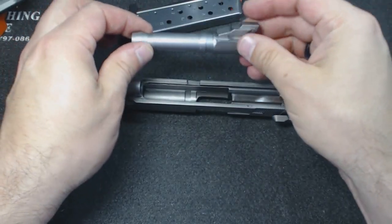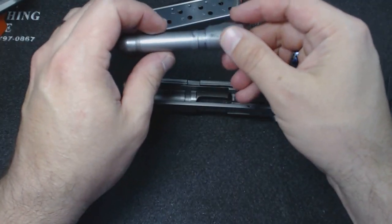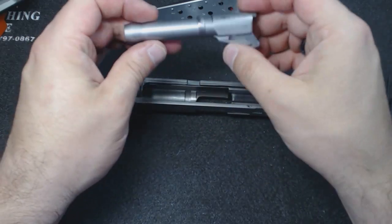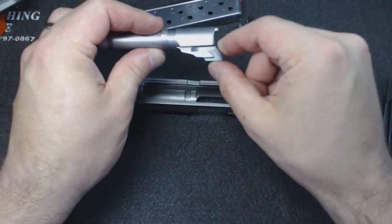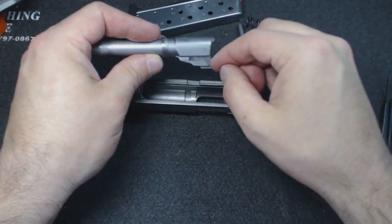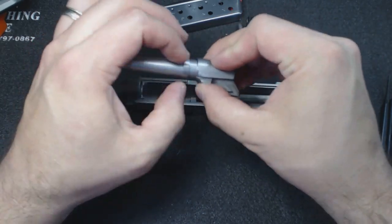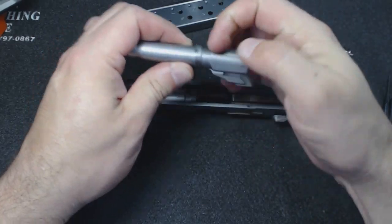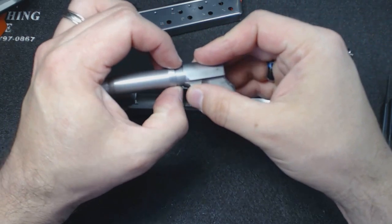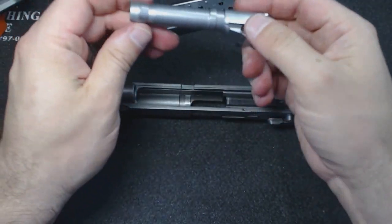But what is unusual is that this is a lug-locked barrel. Not something that was generally done once you moved to a locking block that was down in the frame to have the barrel tilt back, and you generally just use the front of the chamber where it met with the front of the firearm. This one still maintains a locking lug similar to the ones in your 1911.